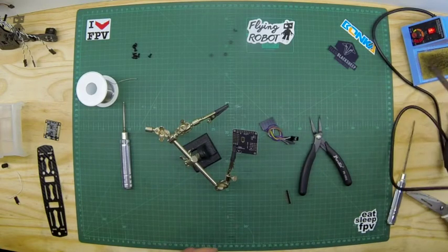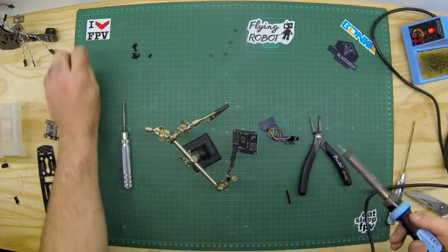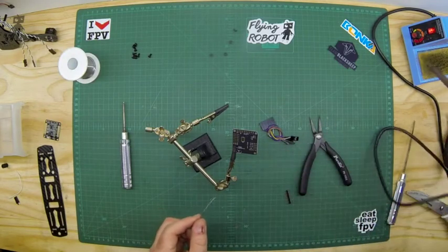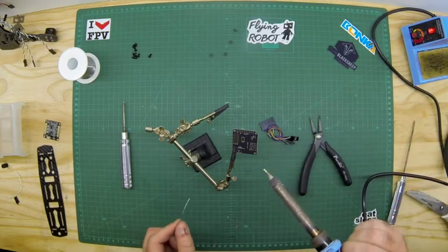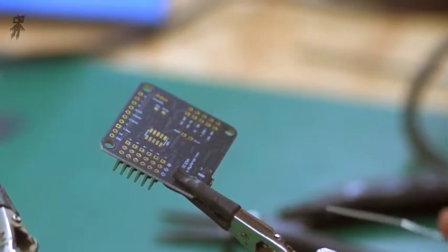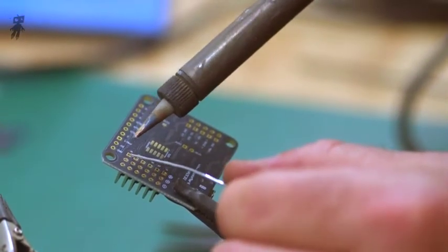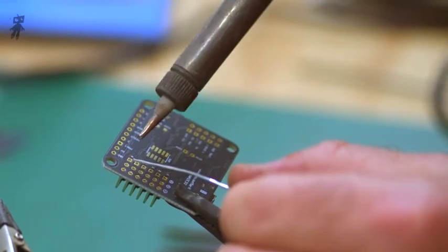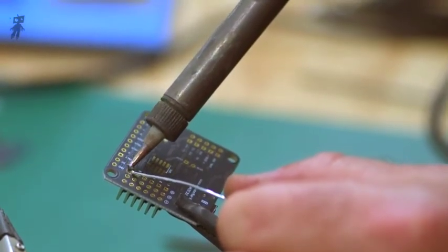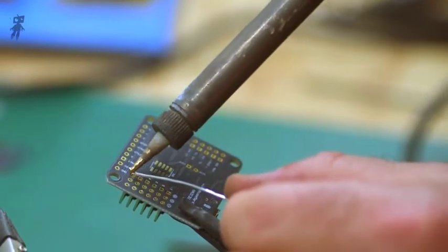Clean off your soldering iron. I'm just going to take a small piece of solder now, so I don't have to hold the whole roll. Now, the secret here is you want to dot your two diagonal ends just first, because what that does is tacks the whole thing in place. Not too hot on the soldering iron, don't put it down too long — put it down for a bit and then let the solder sort of edge onto the board.